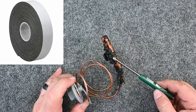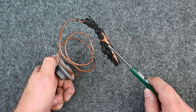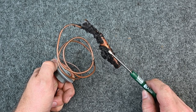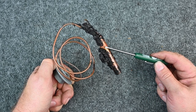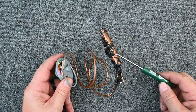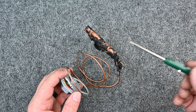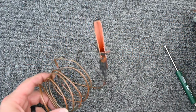They make a self-sticking insulation that wraps around — still put a cable tie on it because it can come loose. There's also an asphalt-like insulation — sticky, makes a horrible gooey mess. Please don't use it for sensing bulbs. The goo gets between the sensing bulb and the line, preventing good contact, and it makes a horrible mess. The sensing bulb itself is hollow — it's a very simple, sealed system containing its own refrigerant charge.